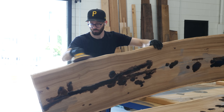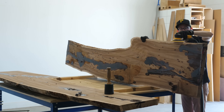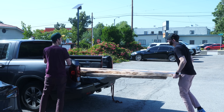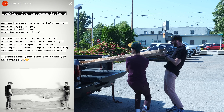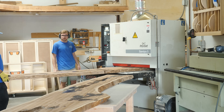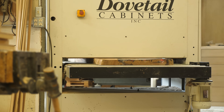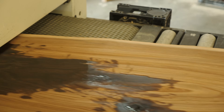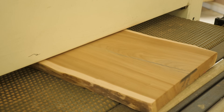So in these shots I'm definitely using a light touch and really just getting rid of anything that's loosely connected. The reason we're sanding away the extra epoxy is because next we could load these guys back into the Ridgeline and take them to get flattened on a wide belt sander. I should thank all of you for helping me find this place — I had posted on Instagram looking for suggestions on a local place with a wide belt sander. A few of you recommended orangecountydrumsanding.com, which turned out to be RW Construction, but their place had burned down. The person there recommended another place called Dovetail Cabinets, and they did a great job. We were even able to talk them into joining MakerBook.io, so if anybody in Southern California is ever looking, there you go.